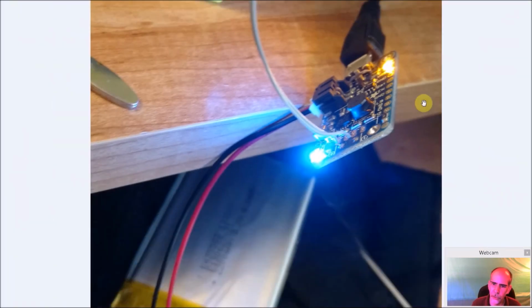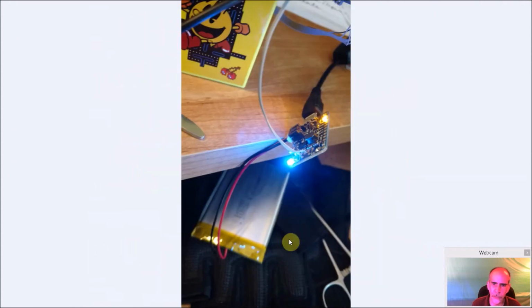These two right here is where you're going to put on your power switch. So you would solder a single pole switch onto here, and when you throw it so that it's open, it'll turn on. When it closes, it turns off. I know it's kind of backwards, but that's how the circuit works. And then you can also pull 5 volts and ground from here as well. So it's a nice little circuit. 20 bucks, I think it's worth it for what it does.